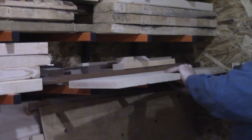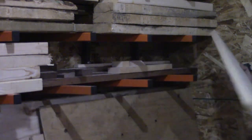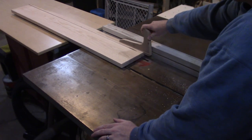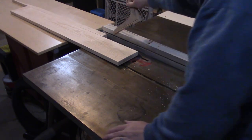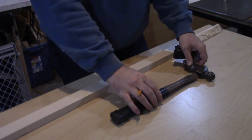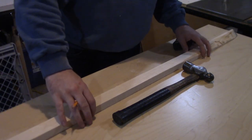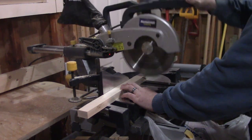Once the hammerhead was cleaned off, I went over to my lumber rack and pulled out a board of ash I had stored there. I took it to my table saw and cut off a one and a half inch strip — this will be my handle. Since I still had the original handle for reference, I pulled it back out of the garbage to cut myself the same length of ash, setting my measurement back from the damaged section and cutting it to size on the miter saw.